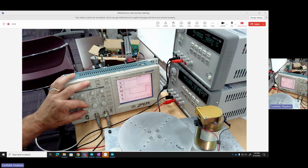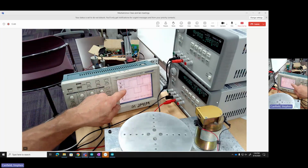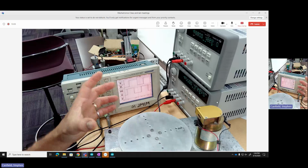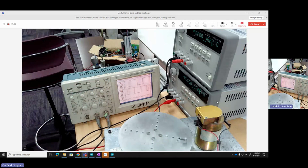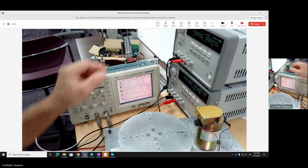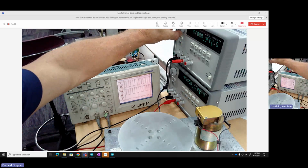Let's zoom out a little bit. You can see pretty big variations because the voltage is so low, and the little bit of friction in the belt is just making it hard to overcome. So it's actually speeding up and slowing down very significantly. I would need some kind of good controller to maintain an accurate speed here. It actually takes almost nothing for me to stop it. Very low voltage, very low current going to this motor. Let me bring it back up. Okay.